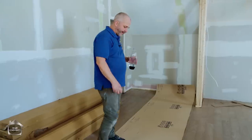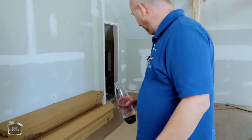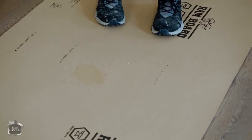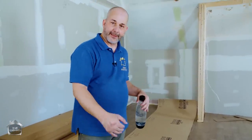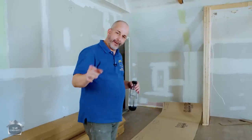Ram Board is really thick dense cardboard that has also been treated with a spill guard — water beads up and gives you lots of time to wipe it clean. When you put it down, place layer against layer and tape the joints for a nice protection layer. Make sure you cut it short of where your baseboards are going to go so you're not fussing around with it during finished carpentry.